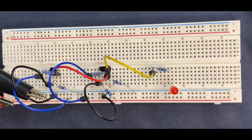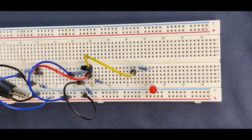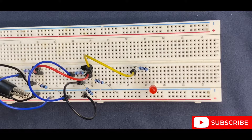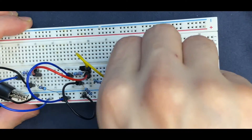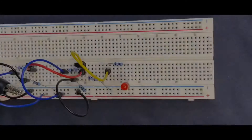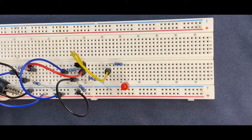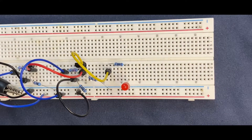Let's make the experiment a little bit interesting. I'm going to build an OR gate from this NOR gate on the same breadboard — I'm going to use this part of the breadboard to build this circuit. So in order to convert the NOR gate to an OR gate, we need an inverter logic gate. I have uploaded a video on inverter logic gate — you can watch the video to get a better understanding. NOR gate actually consists of two inverters connected in parallel to each other. If we want to make a NAND gate, we have to connect the collectors of the transistors in series. So I'm going to build the inverter on the right side of the breadboard and connect it to the NOR gate so that we can get an OR gate at the end.